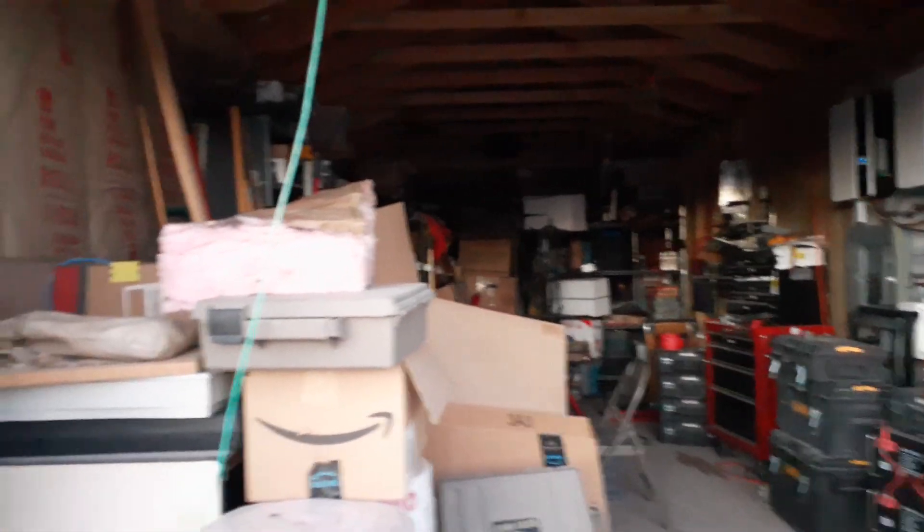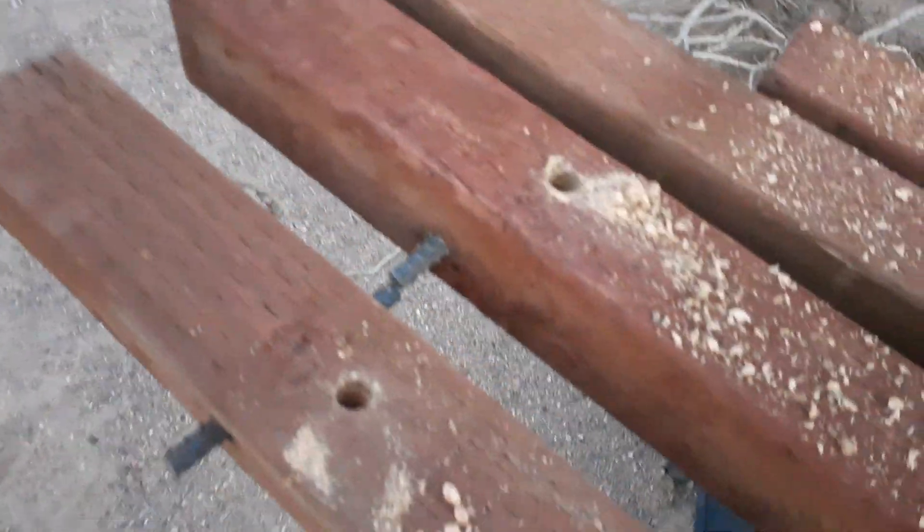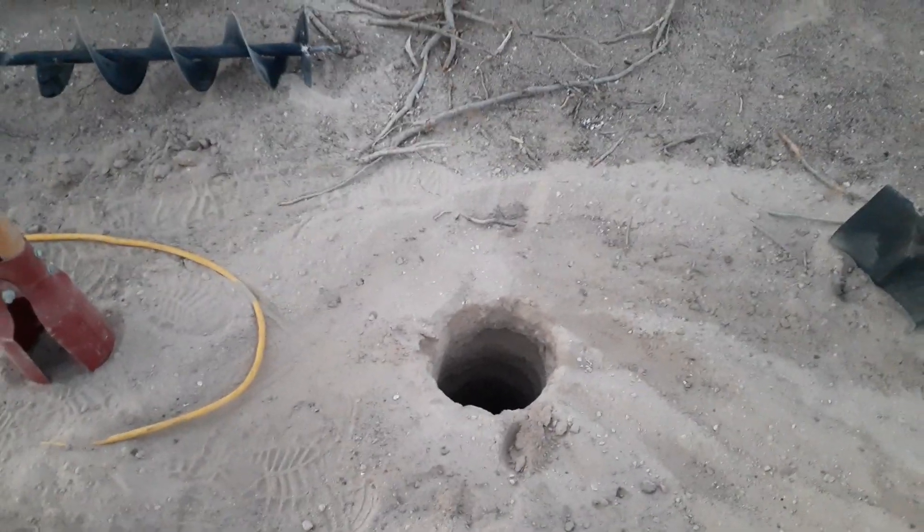Please mind the mess. We're not even a year in here yet and I'm still organizing this shed. I've been cutting rebar today — actually cutting this rebar. The people that constructed the house left me a big old fat piece of rebar that I am going to utilize to its fullest here on these posts. You can see what I'm going to do with it: drilling holes, putting rebar in there so that when I put the end of the post in the hole, the concrete catches and I have a place to anchor to.